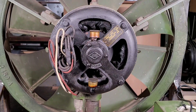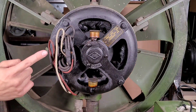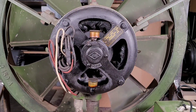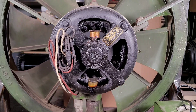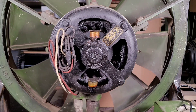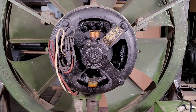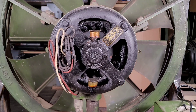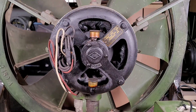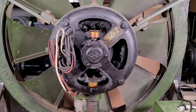Right now it's just three wires coming to this. I might actually make a control box for this and have all six motor leads go down into the control box. This way I can actually wire the fan in delta or Y configuration and I should be able to get a high and a low speed out of it. Being able to wire it in Y configuration, I'll be able to hook this up to my rotary phase converter and see how it starts on the rotary phase converter versus the static phase converter that came from the factory with the fan.